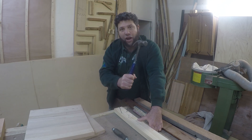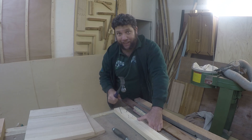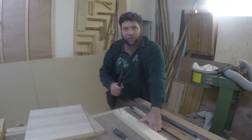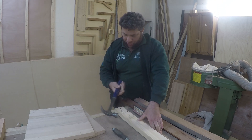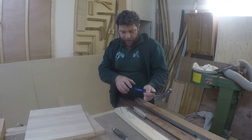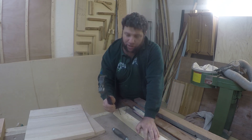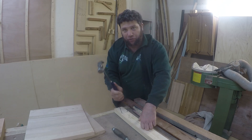You don't want to hold white knuckle. If your knuckles are white, your grip's too tight. Don't go gripping it really hard. There is a time for that — if I'm doing demolition and I've got a mash hammer, then I have white knuckle because I'm really giving it a good slog. Another thing: almost all hammers will taper at the end, as do tomahawks and axes. The reason is so your hand gets locked into position and it doesn't fly out when you're doing a big hit. I'm still focusing on these fingers pushing the hammer back into that lifeline in the middle of my hand.